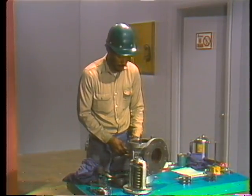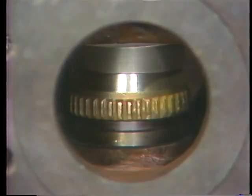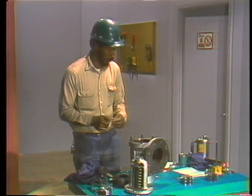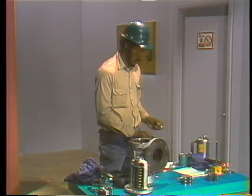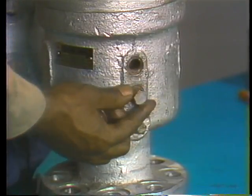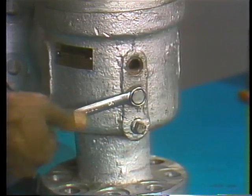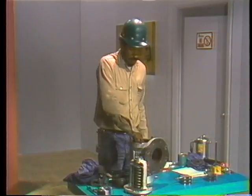Knowing this, he inserts a screwdriver through the hole for the lower adjusting ring pin and turns the ring counterclockwise until it touches the block — this gives him his starting point for turning the ring clockwise 10 full notches. Before doing anything else, he must lock the lower ring in position with a locking pin. He lubricates the threads on the pin, then turns the pin into the casing as far as it will go. A wrench helps to tighten the pin into the notches on the ring. He then removes the lapping block and checks that the pin is holding the ring in position.